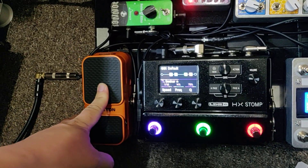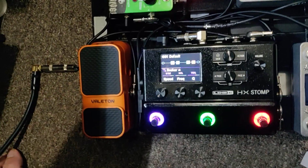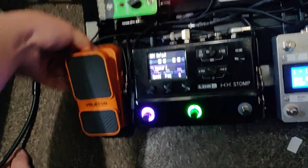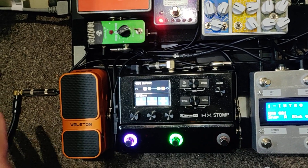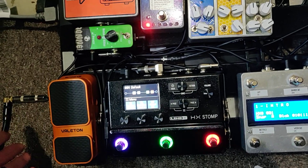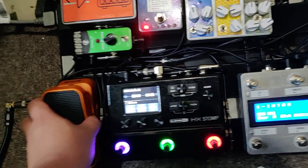This expression slash volume pedal — you wire it just like a regular volume pedal. It doesn't go into the expression jack, so it doesn't take up a block — that's why I built it. You have your regular signal in and signal out, and the expression part goes into the HX Stomp. There's a foot switch on here: when you hit it, it'll true-bypass the volume pot so the signal goes straight through at unity volume, and this now becomes an expression pedal for the HX Stomp. When you hit it again, the expression pedal turns off and you can turn the block off too through the HX, and it turns back into a regular volume pedal.